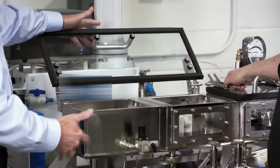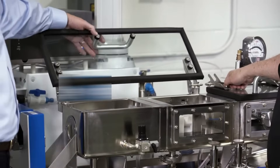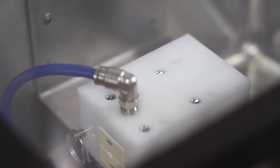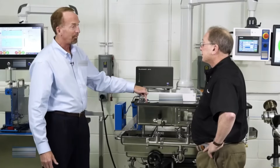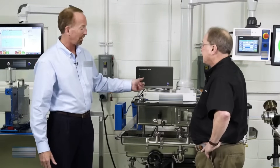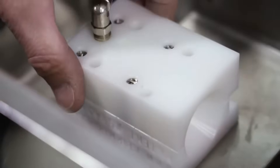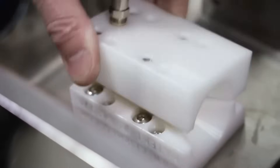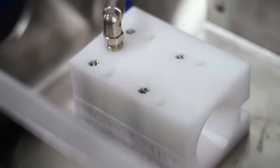When you're dewatering, that water can be splashing on the floor that's coming off the tube. So it's a nice feature to be able to close the lid and cut the noise down. And as you mentioned, we're using a specific type of air wipe. The air wipe itself has interchangeable inserts, so you can actually size the air wipe for the tube that you're making, which will cut down on the amount of air that you need to use.